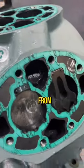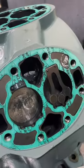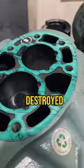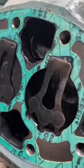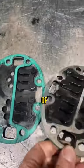You can see it's black from the compressor motor burnout, but there are no broken valves and the cylinders aren't destroyed — you can see that on both sides. Taking a look at the valve plates, there are no suction or discharge valves broken. You can see on both sides none of them are broken.